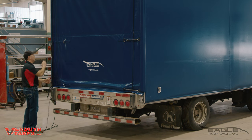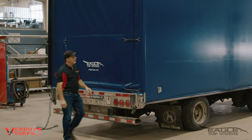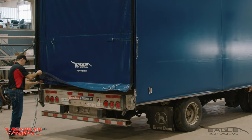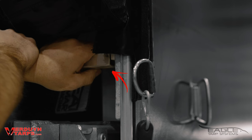We're going to go to the back door now where we have a new feature. The rain flaps still open the same as all of our previous systems, but now there is a locking bar that is inside the rear door. The difference here is we've added a small piece of UHMW. You only have to apply some downward pressure and the bar will pop out. This new feature will put the pressure on the bar instead of the velcro, which will help your velcro last longer.